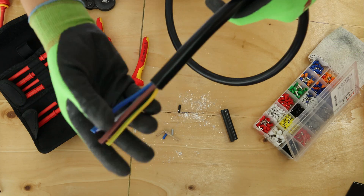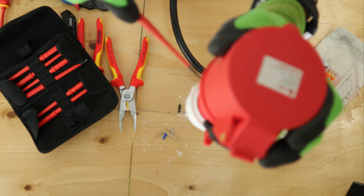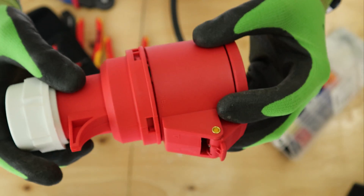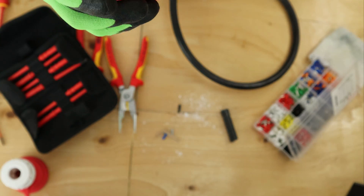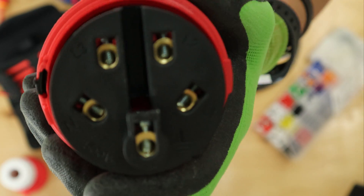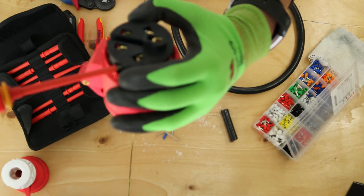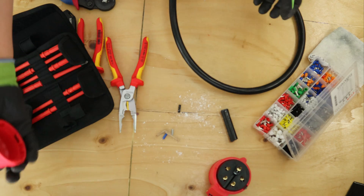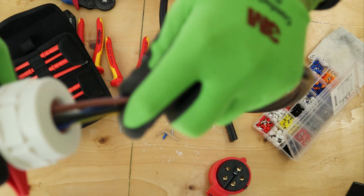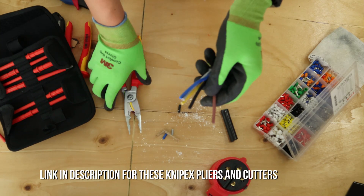Let's do the female side. Same process — strip the cable and pop the casing open. It's the same on both ends. It does depend on what kind of commando socket and plug you've got, but for this one it's really easy — that's why I love them. It's slightly different looking but pretty much the same. You've got five terminals: L1, L2, L3, Neutral and Earth. The earth also has two screws — remember to loosen both of them so it's prepped ready for the cables. Remember to pop the casing through the cable first.